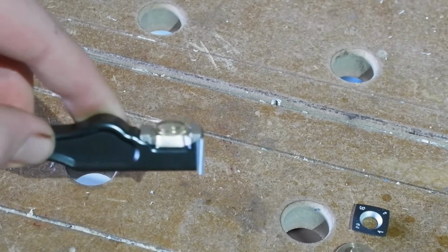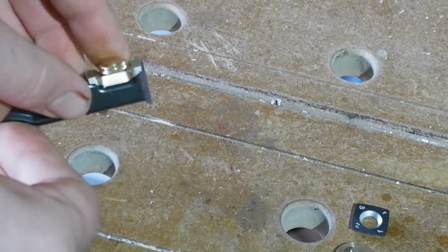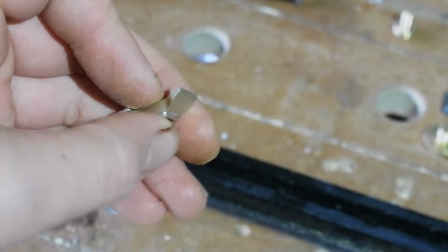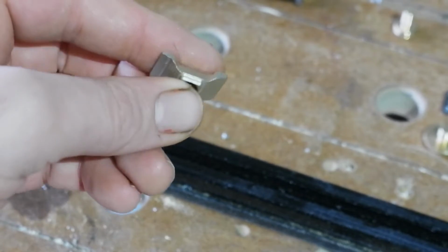At the head of the tool, a gold coloured aluminium fixing is for blade setting. This is reversible, and if I take it off, you should be able to see that one face is flat for setting the square blade, the other slightly curved to match and set the contour blade. A simple enough thing, but useful for setting the blades properly and stopping it from spinning when you tighten.